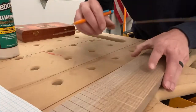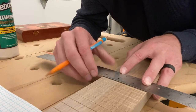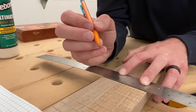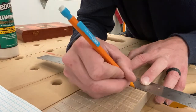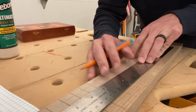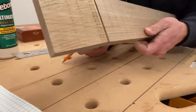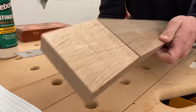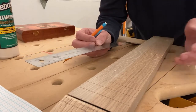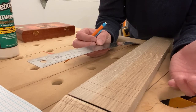When I get down to the very bottom fret right here, I want this to be an inch and three-quarters wide. Finding the inch-and-a-half center point — an inch and three-quarters, that's easier to do in my head: four-eighths and three-eighths is seven-eighths of an inch. I can take this straight edge and draw a line between these two points. Whether you're doing that with a bandsaw, jigsaw, coping saw, or just chiseling it out, there are different options.